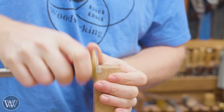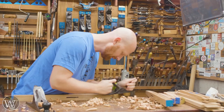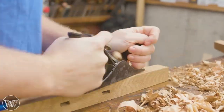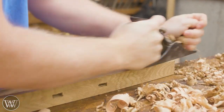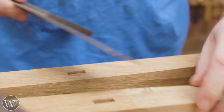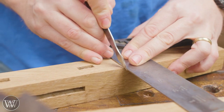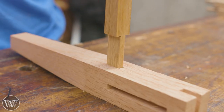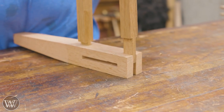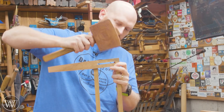It's one of these things that is so much faster to do by hand than it is to set up a jig on the table saw, and you can really get a clean setup very quickly and very simply. I have a whole video dedicated to how to taper legs by hand. All you need is a mark at the top of the taper and a mark on the bottom end of the leg and you play connect the dots and you've got a taper. A lot of people will then put a little carving detail around to signify the top of the taper — I just like to leave it alone and give a nice smooth transition from one to the other.